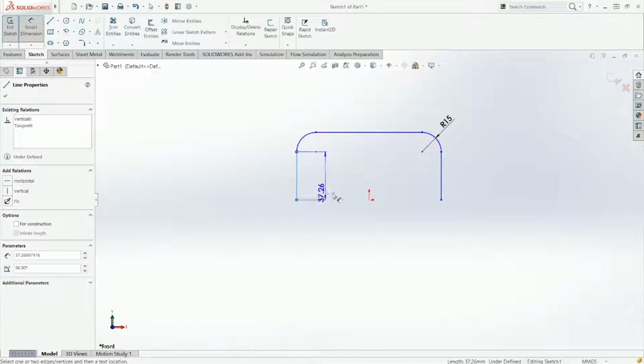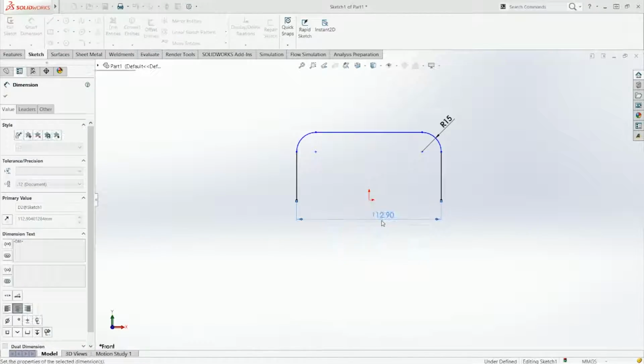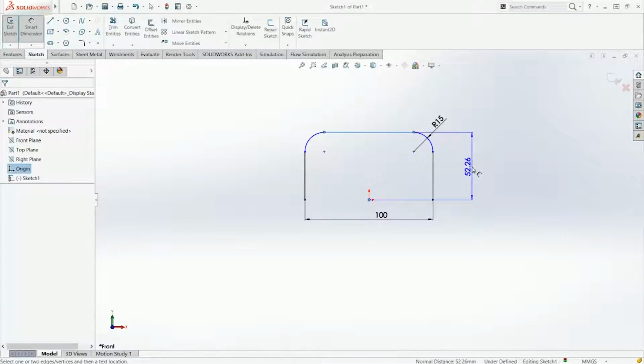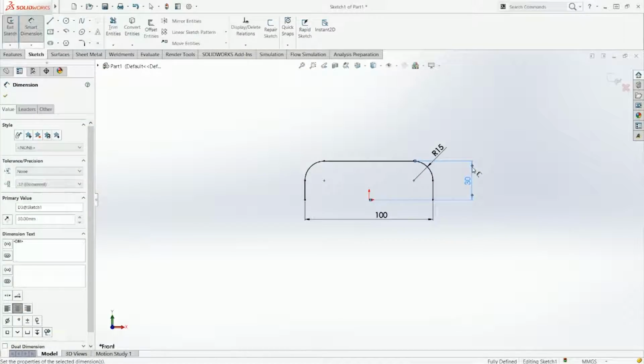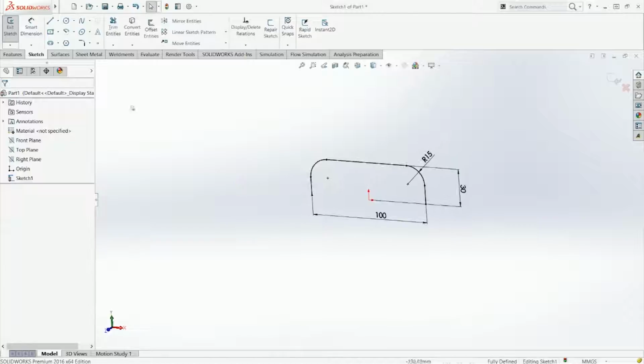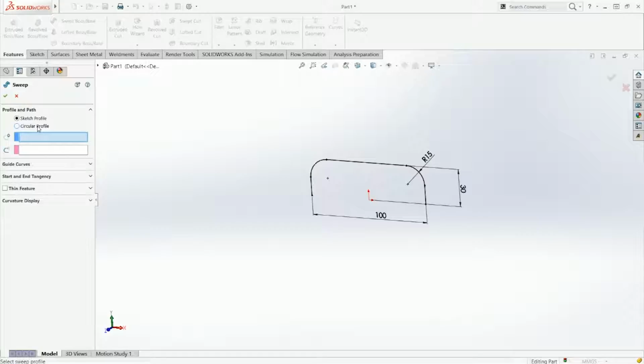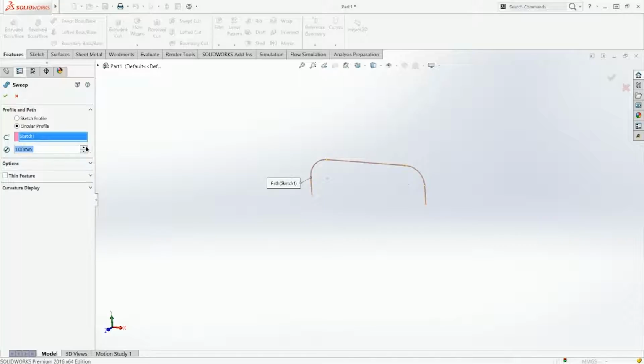So we know the separation between these two needs to be 100. And now the handle itself will probably be like 30. Yeah. So now, new in SolidWorks 2016, the sweep boss doesn't need a profile as long as you want it circular. So just click on the tangent profile and make it so it's bigger. So I remember our screw size is M8, so we want at least a 4 mil clearance on both sides, which would be 16.